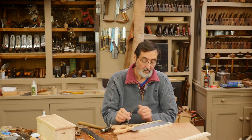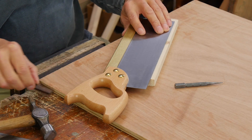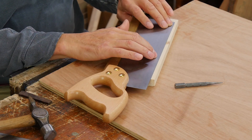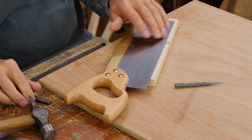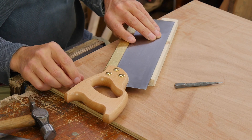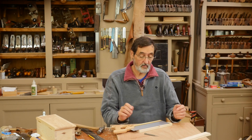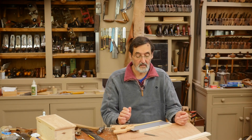So I've got my plate suspended here. The one thing you don't want is for this to be rocking when you're working it. Take a piece of wood that's thick enough to take up half the handle and then slide a wedge underneath the handle — that will make the plate solid enough. You can clamp it if you want to the bench top or to whatever; find some way, it's kind of hard to do.